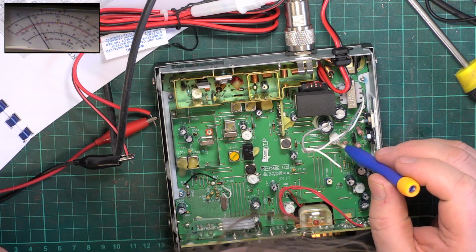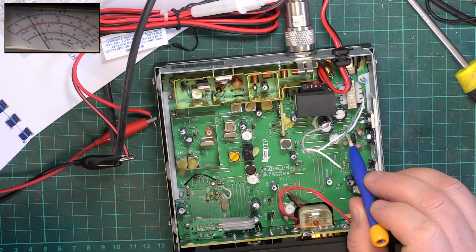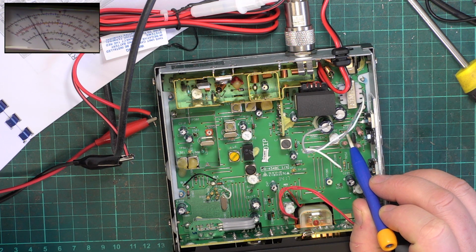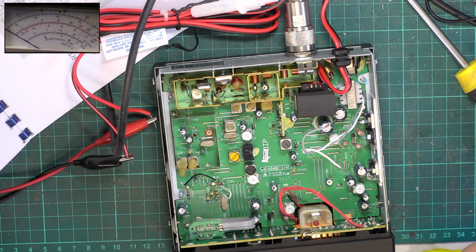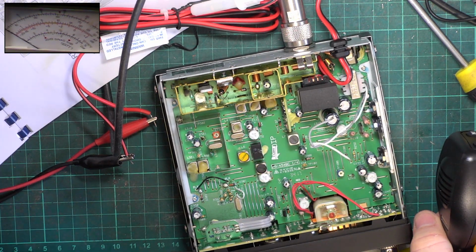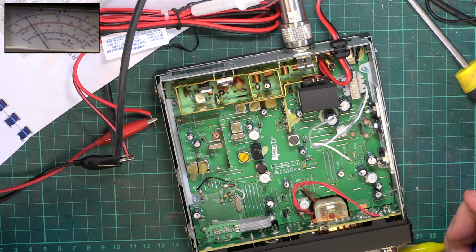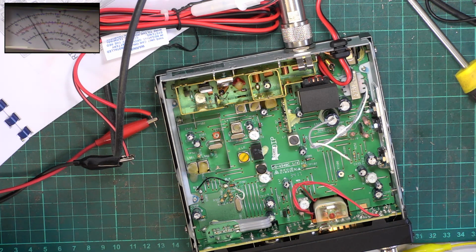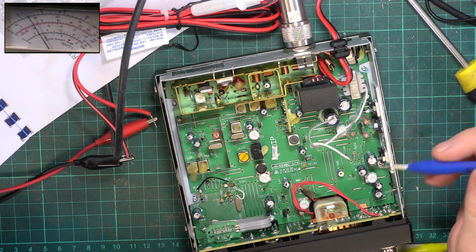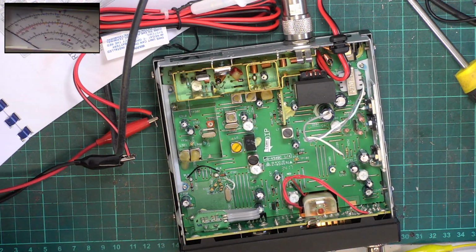there's 202. RT203 has been linked with a permanent resistor. So that's already done. By the by, the power supply's current limiting. That's because we were in AM and it draws more current on AM. So now go to FM. So that was a pointless exercise.